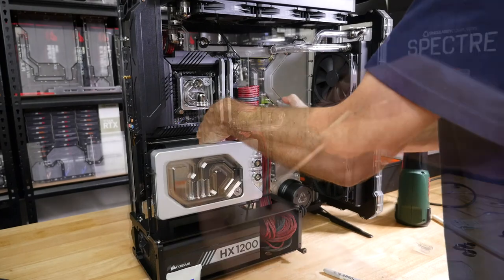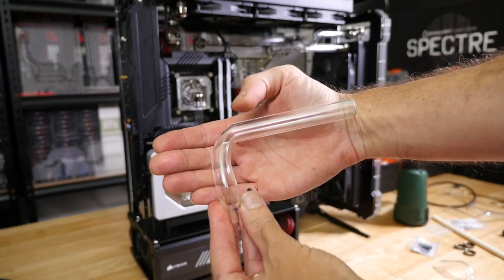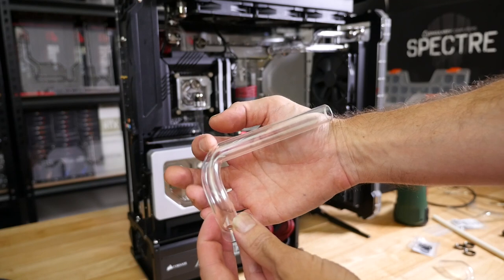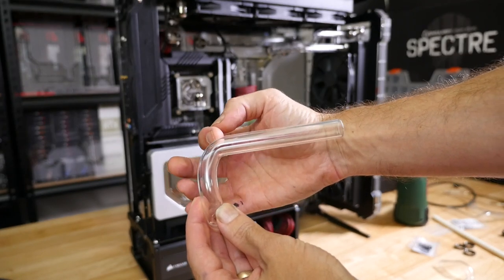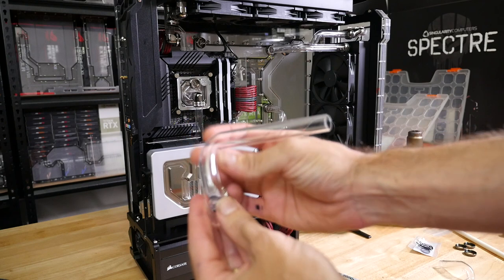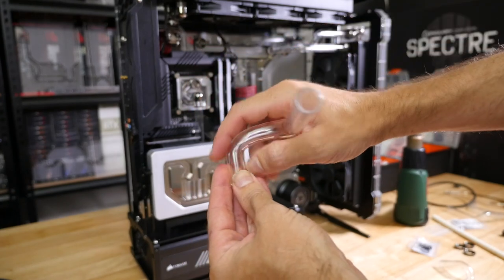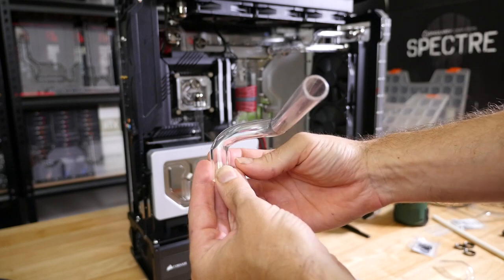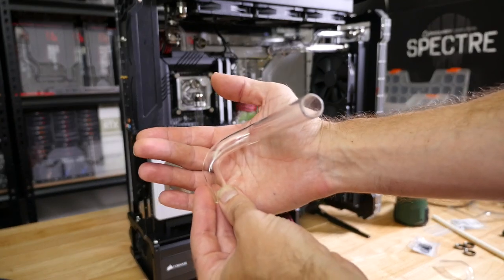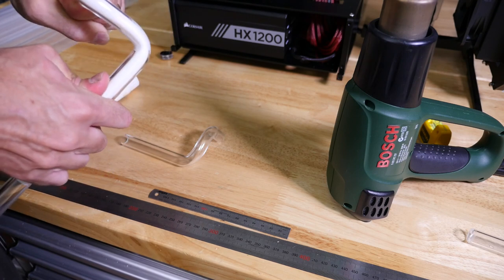Because this one was such a large offset, I had to heat a long length of the tube. Really, this is getting to the point where it could be done in two separate bends. But this time I'm going to heat a bit more of the tube, because I have to pull pretty tightly on here — there's a defined point here and a very defined point here. I would like that bend to be a bit more gradual so that it's not so squashed. You can see this distance really closes up through this bend — that's not good. And the same thing happens here, even worse, and there's a very defined point on this side which is very crushed. This has happened because I didn't quite heat enough of the tube and tried to pull a very big offset. So I've heated a nice big long length this time and I'm going to pull the offset into shape.